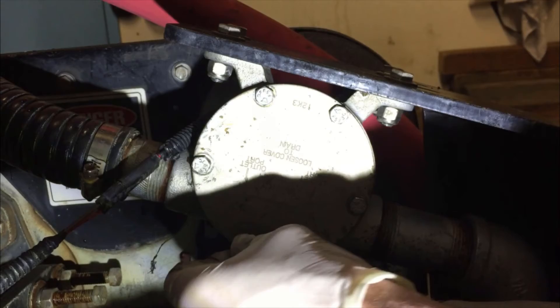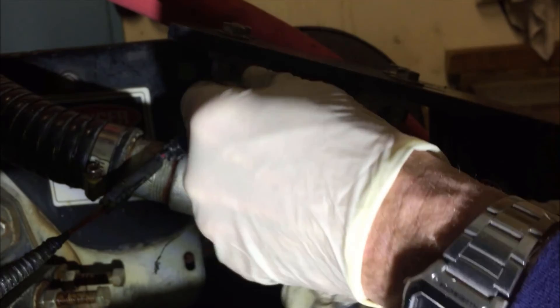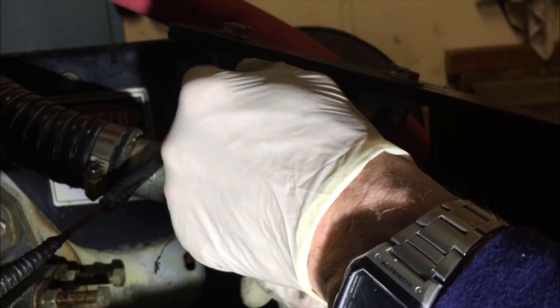I know it's not like a tire but we'll tighten them in a sequence — this one then this one. That's tight. Let's do them all; it's pretty secure. That's the wash water pump done. The black impeller is the standard one that comes with the machine. If you're buying a new one, get the blue one — it's soaked in oil so it'll last longer and won't burn up if you run it dry or run out of wash water. This old one's toast, so we'll give it the toss. Stay cool.